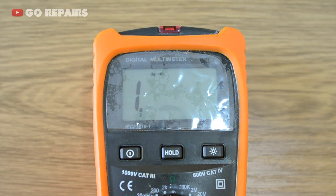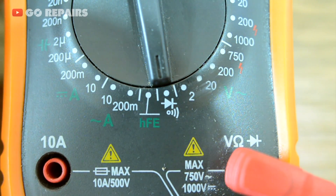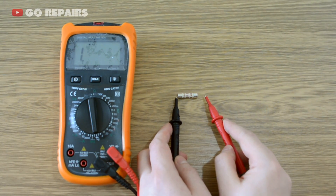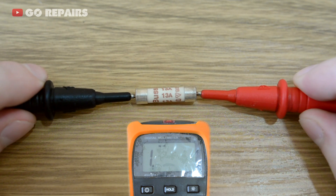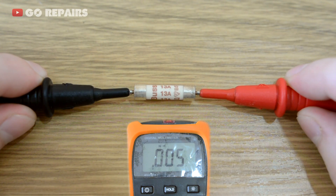I'm going to use a digital multimeter, setting it to the buzz test, which checks for continuity — in plain English, making sure there isn't a break in the electrical connection. Inside the fuse is a tiny wire which burns out if it's blown, in which case I'd just replace it for the same rating. But this fuse is okay, so I'll check the lead to the soldering iron.